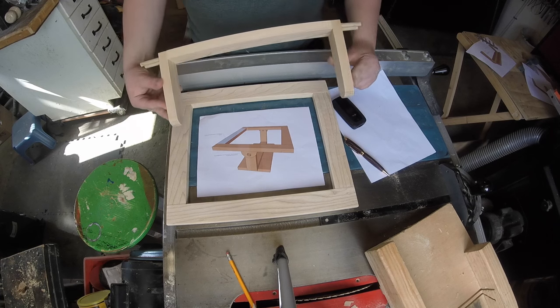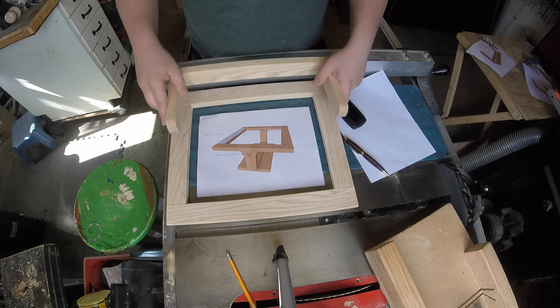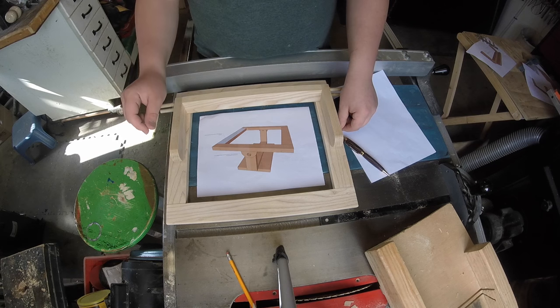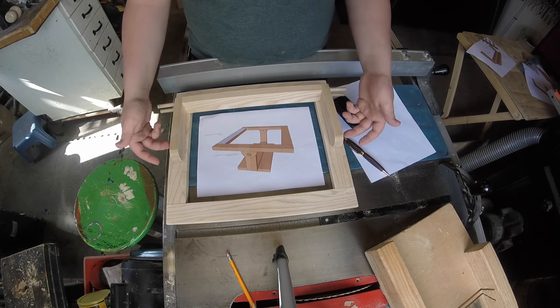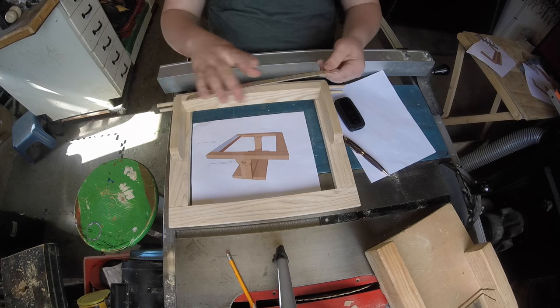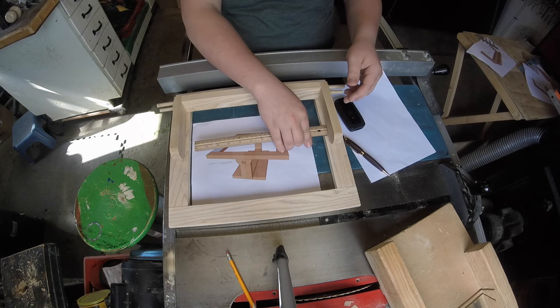The problem that you will most likely run into on building these frames, that I have just run into myself, is that if you remove too much material or make cuts wrong, you will end up having to hand measure the thickness of each of those half circle pieces so that it's a nice perfect fit between the two posts. Now, these measurements might not be exactly correct. It depends on what your frame build is at, but what I'm going to do is measure the gap from the inside so it's even on both sides.